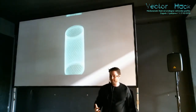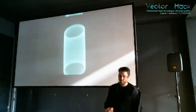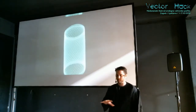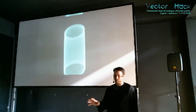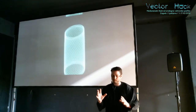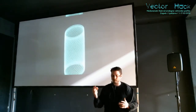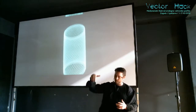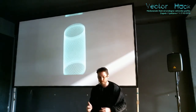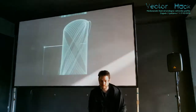How similar are the circuits between the Electro circuit and the weight circuits? Because the weight circuits, both of them are really quite the same. One's just a bit fancier than the other. Yeah, the synth shape and the oscilloscope graphic cards are really similar, but the Electro one is completely different. The only thing they share is sync, a master clock, but this one is a bunch of dampened sines, 2 dampened sines. It's like you impulse a filter, and it rings a little bit. It has a dampening quality and does a sine wave. And it's 2 of those together to make the XY, and the frequency relationships between them make the spiral shapes like that.